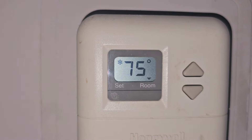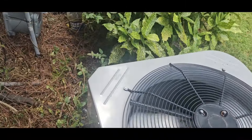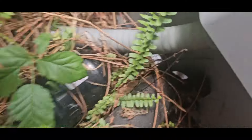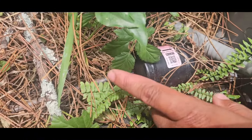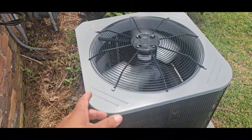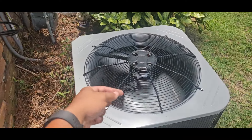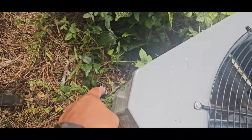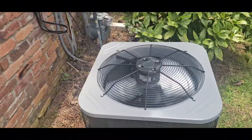The backlight display doesn't work right now. It's reading 75 — that's weird, it was just reading 73. The arrow for filter dryers is not supposed to go to the condenser — it's supposed to go to the evaporator coil. With this being a straight AC, there's no reversing valve, and it's a gas furnace — not a dual fuel setup. Refrigerant comes out of the compressor, goes through the condenser, to the evaporator coil, then back through the suction line to the compressor. So the backwards filter dryer is definitely an issue, though I don't know if that caused whatever they were reporting.